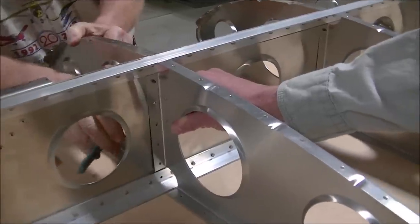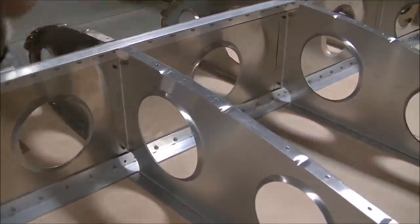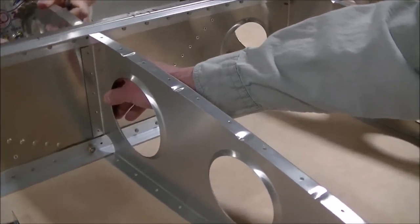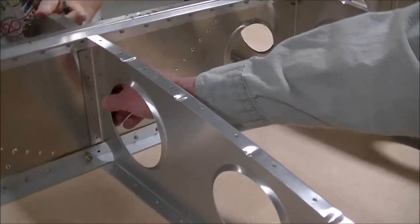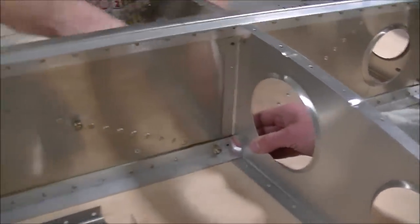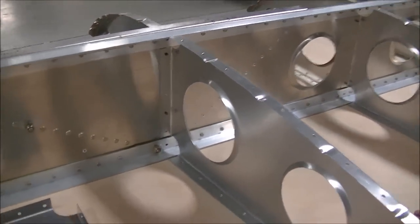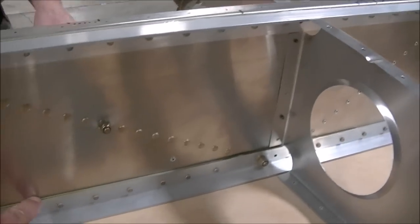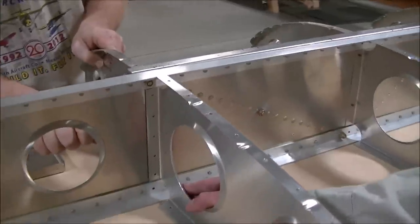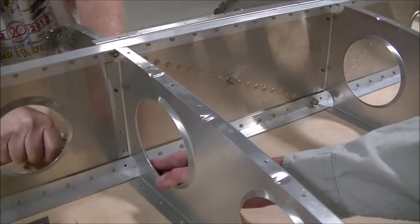It's all 6061 T6 aluminum alloy, so it's already very corrosion resistant to start with. Some folks do use additional corrosion protection as Roger mentioned, but depending on where your airplane will be located it's really quite optional. The wing spar itself has been completely pre-manufactured and has already been solid riveted at the factory. You can see a light green film where zinc primer has been applied between the seams at the factory — this is supplied on all factory-built wing spars in the kit.